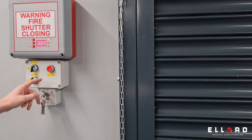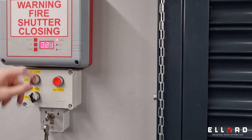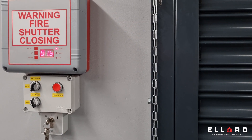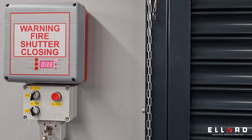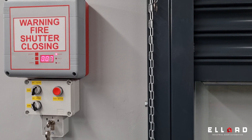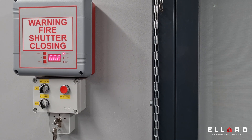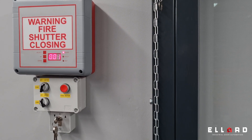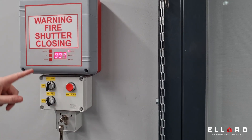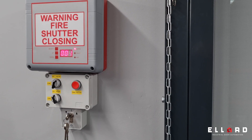The panic circuit will then incorporate — the door is now reopening for 30 seconds. It will delay for 12 seconds and then re-close. This is active all the time as long as the fire alarm signal is still active. You can reopen and close the door as many times as you like.